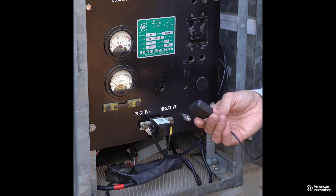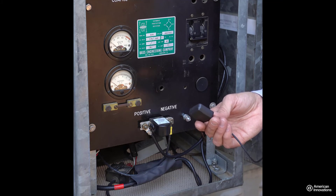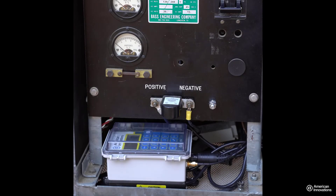If a metal surface is unavailable, glue a flat washer to an appropriate surface and attach the antenna to the flat washer. After all connections have been made, place the GPS 360 interrupter in the bottom of the rectifier cabinet, or you may attach it to one of the inner side walls of the rectifier cabinet using magnets.